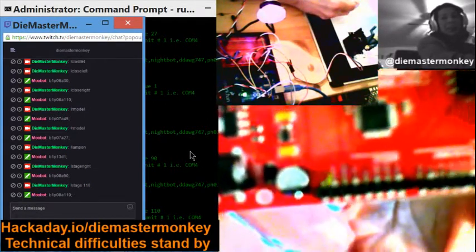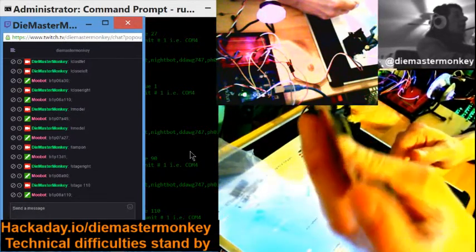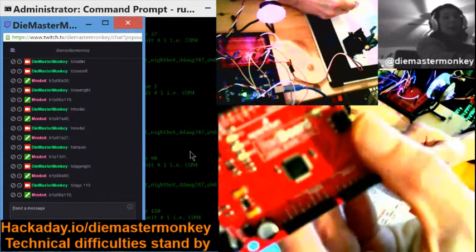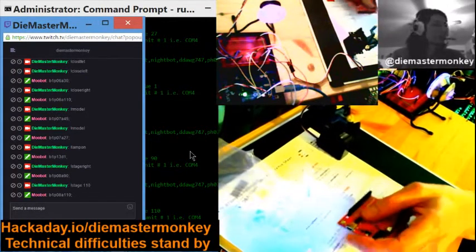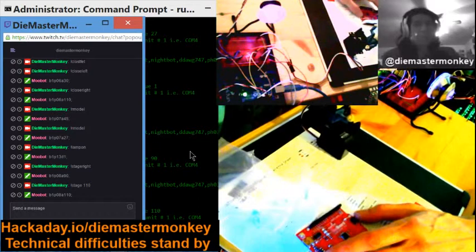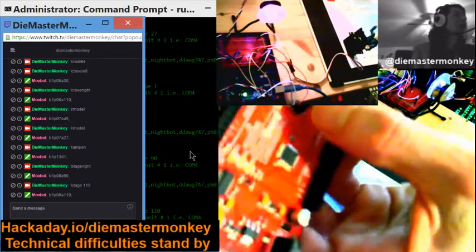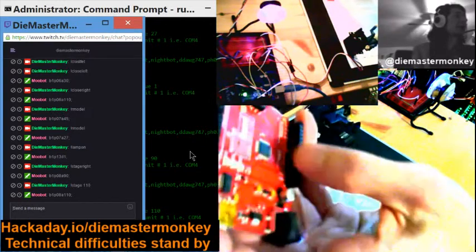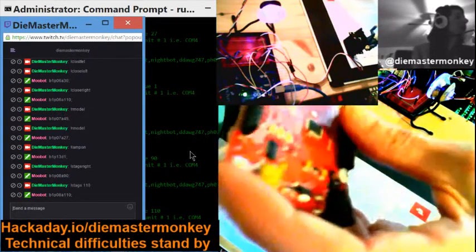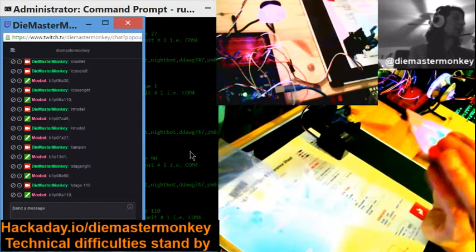We may read the specifications, but it is pinout compatible with the Arduino Uno. It has the power supply, the jumpers and the ISP header. So all the standard Uno stuff. If you've compared the Uno with the other versions of the Arduino, you'll know the features that distinguish it particularly are these. It does still retain the ISP header, it has the USB connector, a reset button, the full height female headers, and the DC jack.